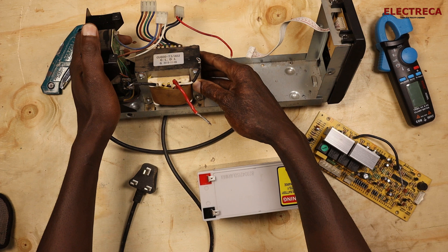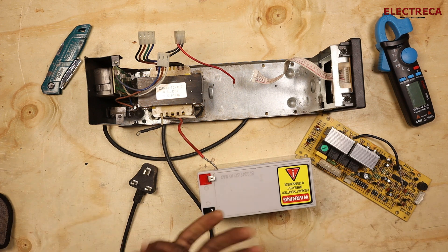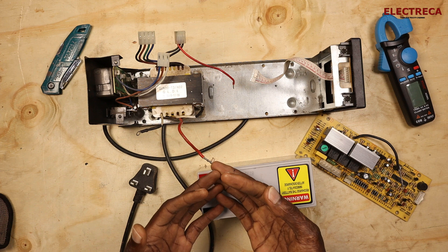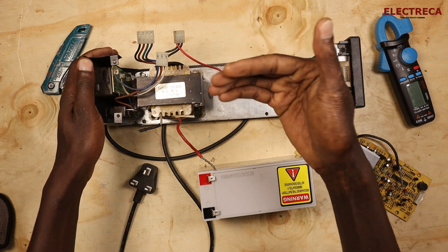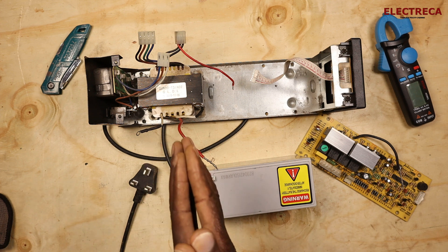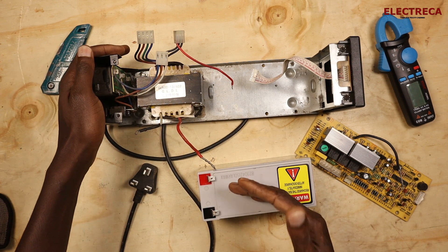This here is a step-up transformer. Because you have 12V DC from the battery that needs to be stepped up and then converted back to AC, that is the purpose of this transformer. During an outage, when the DC is being converted to AC, this transformer works the most.